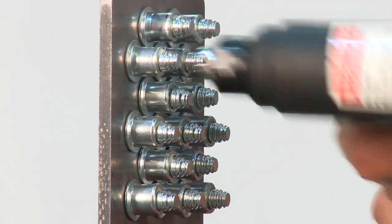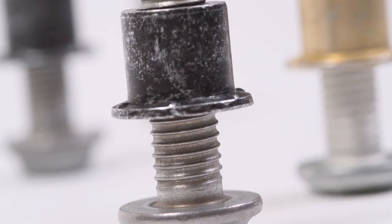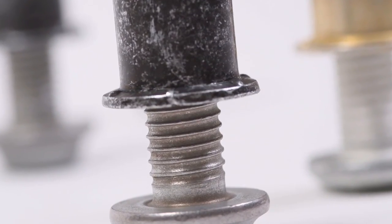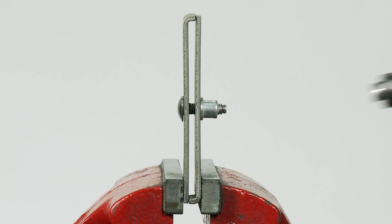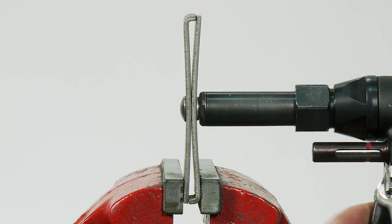The material on the bolt is the same as a regular bolt, but the threads are different — they're lock threads. Those threads have a different function than the threads on a regular nut and bolt. The Bobtail groove is shallow. We don't need a deep groove because it doesn't have to have any tolerance fit with threads — we swage the collar in. So we have a very shallow groove with a big root radius in there, and that gives us high fatigue strength. We're looking at five times the fatigue strength of a conventional thread.